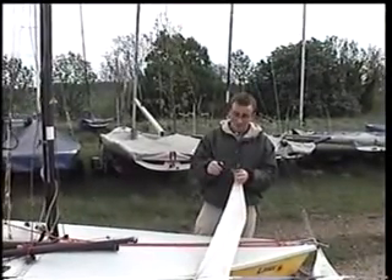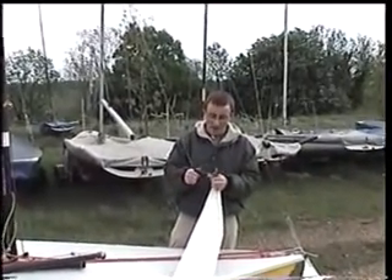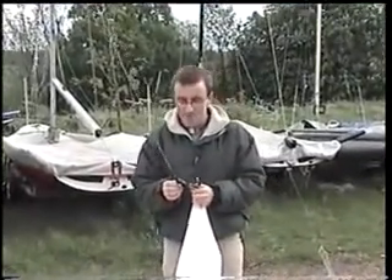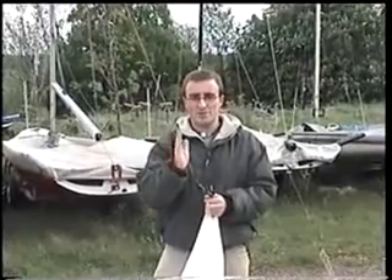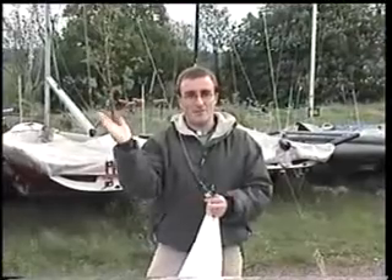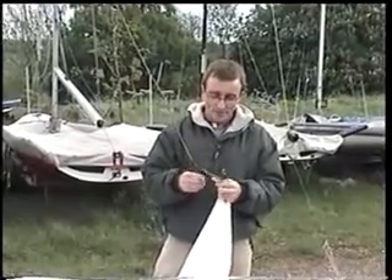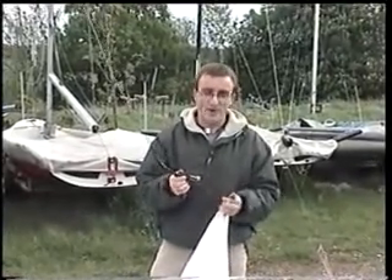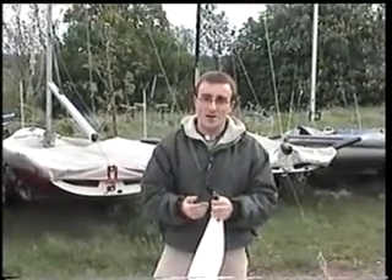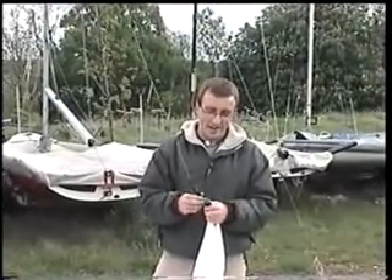Now when you attach the jib to the halyard, I've actually got a chain plate which has come off the bottom of one of the shrouds — a spare one. Other people use shackles. The reason for using this is that if you vary the angle of your mast, the length of the forestay will vary, and I can put it in different holes depending on forestay length. Also, when you buy a jib, the wire down the front is often tight and stretches over time, so having adjustable shackles lets you compensate for variance in halyard system length.